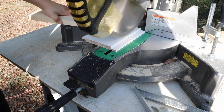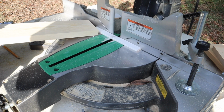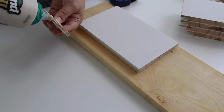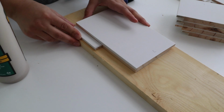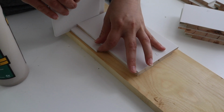Be very careful with these edge cuts. I used my miter saw and a scrap board to hold the shiplap board in place while cutting the edge off. You could also use a jigsaw to do these custom cuts. Because we still need part of the shiplap edge on the board bordering the beginning of the 1x4, we cut the edge piece to 3.5 inches, which is the same height as the 1x4. We used wood glue to attach it back on the board edge.